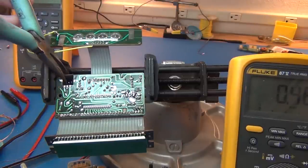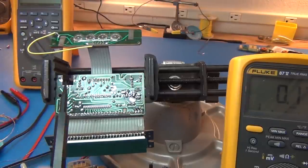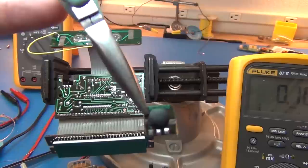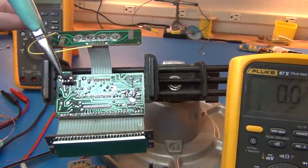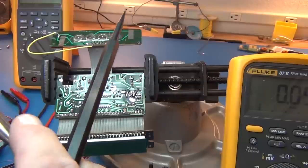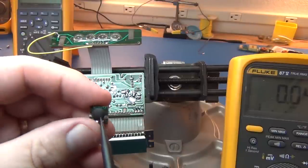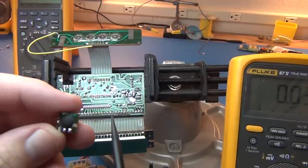Literally, they basically sliced out a piece of the board over here, and they've got this little chip on board. You see? It's got just little solder tabs. What they do is they slide it in there on the board, and then they just short those tabs. And this alarm clock, of course, works perfectly fine with just that LM8560 chip in here. It doesn't need this cute little onboard thing that just makes it sound like a horn beep.